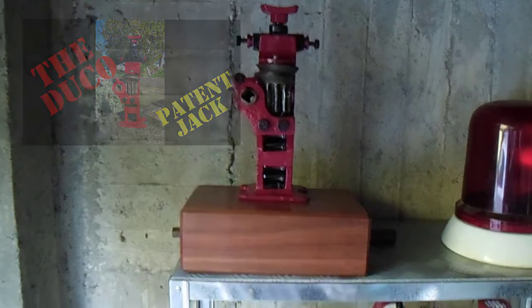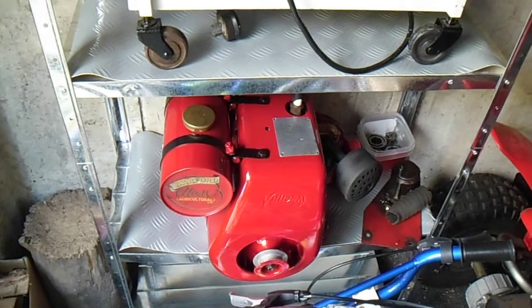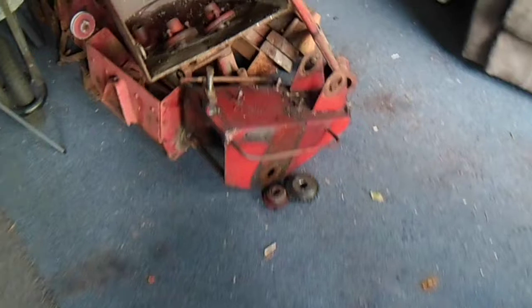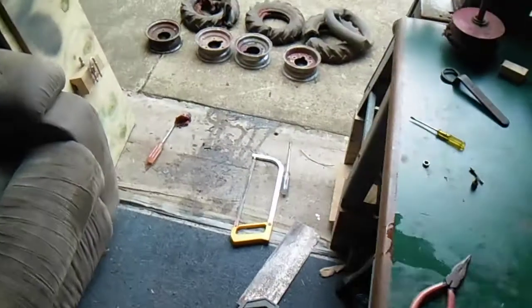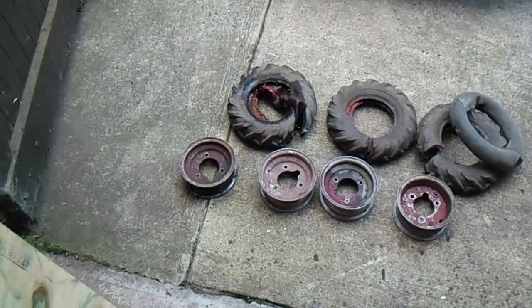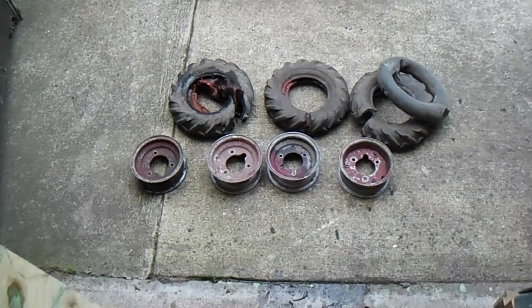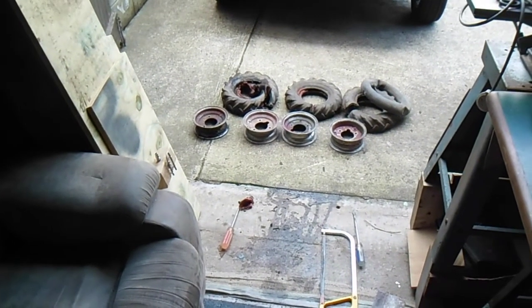I might add a little bit more into this video but I'd say it's probably getting a bit long, so I don't know how much more I'll add before I cut this one off and start a new episode. We've just got the frame to get cleaned up now, and finish doing these handlebars. Now the wheels are off the rims, they'll be a nice easy job — give them a pressure wash and a blast and some primer. I'm going to put the new tyres onto the rims before I paint them, and then we won't fill the tubes with air to seat them on their beads yet. We'll wait until they're painted, because that way I can push the tyre back away from the rim, put a ring of cardboard or masking tape around there to paint them up, and then inflate them once they're painted so I don't damage the paint.